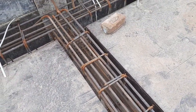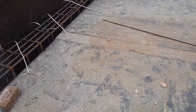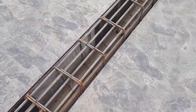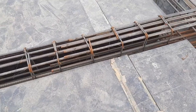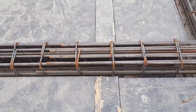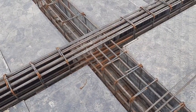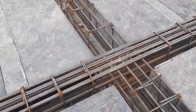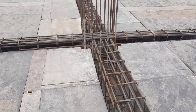You can see clearly they used four steel rods at the top and four at the bottom, but this is the wrong design. At the tension zone they should use maximum steel rods, and at the top they should use minimum, because concrete is strong in compression but weak in tension. Two bars are used at the sides, giving a total of 10 steel rods.